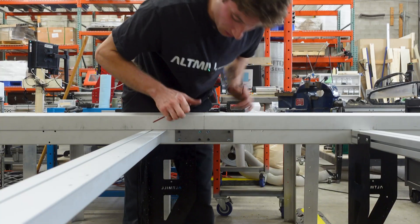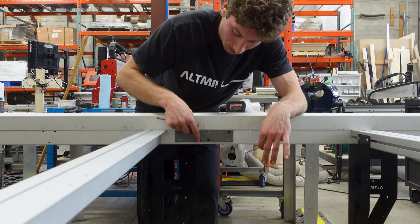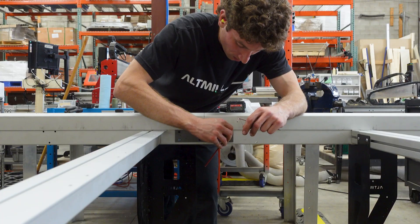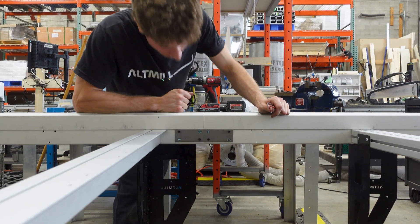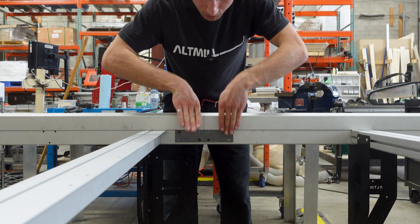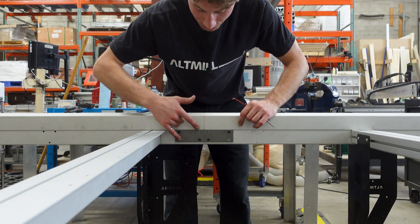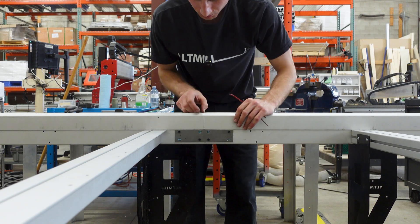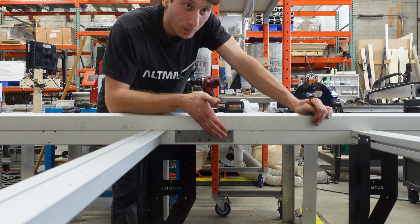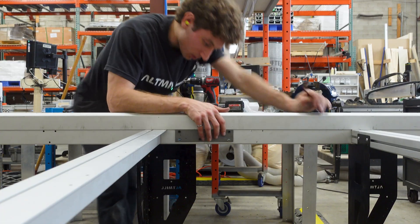So these countersink ones are the action screws that are creating some sort of movement, and then the socket head screws are the clamping screws — that's the purpose of them. So with this plate here, the rails can't move with respect to each other in this direction. That angled slot feature pulls them together so that this butt joint is — this was just brute force, right off the start: make it, put it together. No leveling feet on these at all, and it goes together just fine.